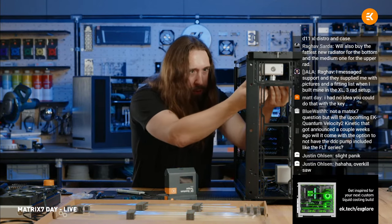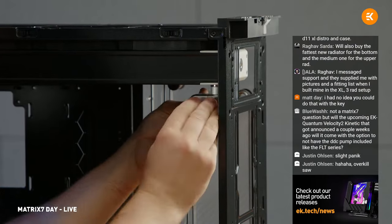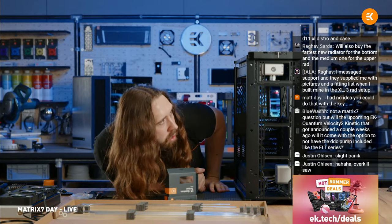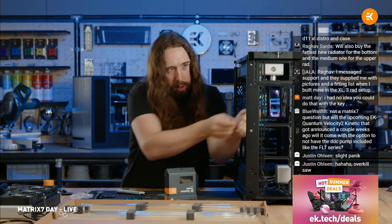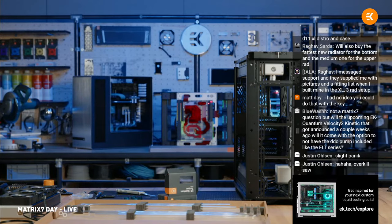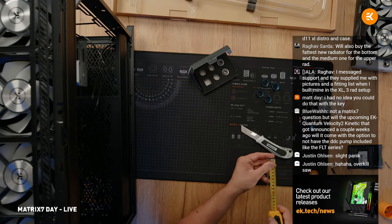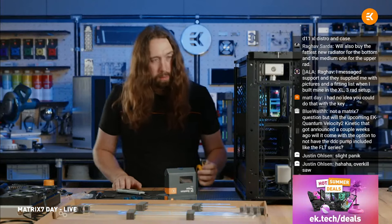Okay, let's see how I did. I did the front one first, which I don't know what I was thinking, but I did it. No problem there. It's in both of the O-rings very nicely. As best I can tell, it looks pretty straight. I know I'm going to need one 56 millimeters shorter for the back fitting. So now I can check this one and measure the other one. This one is 115. Okay, let's say 116. Take my 56 off, so 60 millimeters for the other one.